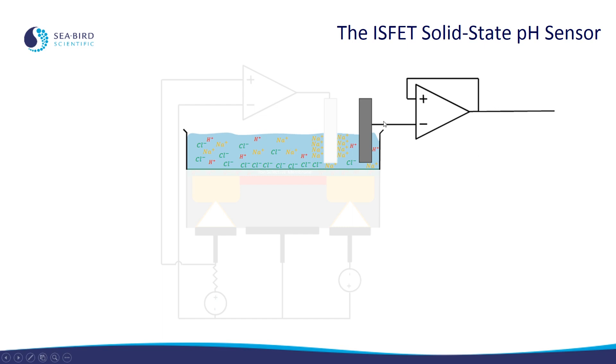Finally, we're going to discuss the reference electrode and its associated electronics. It is the voltage on the reference electrode which is ultimately used to calculate pH. This circuit here is an op amp used to measure the voltage on the reference electrode without drawing very much current from it. Drawing too much current from it would upset its delicate measurement. The reason that the voltage on the reference electrode is ultimately a measure of pH is that it is effectively measuring the number of chloride ions that were needed to counteract the positive hydrogen ions and keep the ISFET in a constant bias condition.